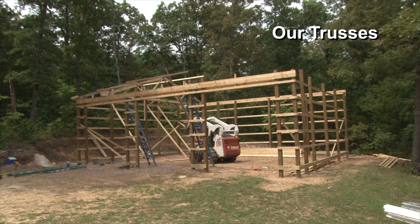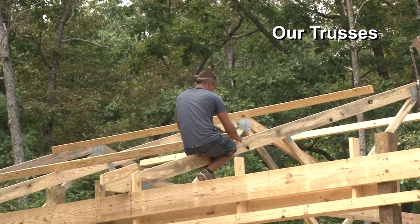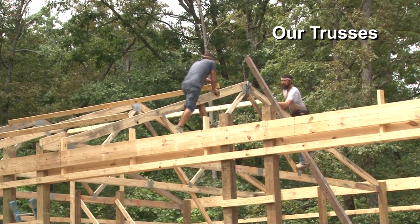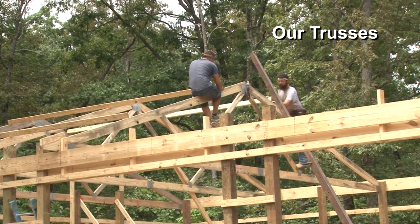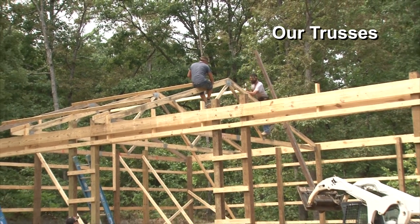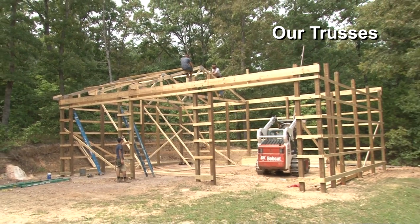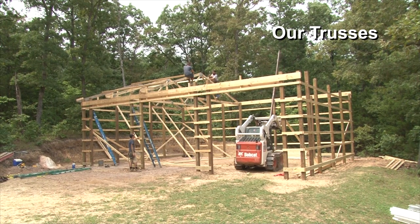Another thing about our trusses — even an eight-foot center truss, if we build a hay barn, we always add a ceiling load to it. In addition to that 20-pound-per-square-foot snow load, we're adding a five-pound-per-square-foot ceiling load. The dynamic there is that if you never hang a ceiling in it, you're fine. But if you get five or ten years down the road and, like most people, you're not sure what you're going to do with the building, and you say, 'I want to put a ceiling in there' — you're set. You're not abusing the truss or misusing the engineering. So that's kind of baked in the cake when you build with Lone Oak.